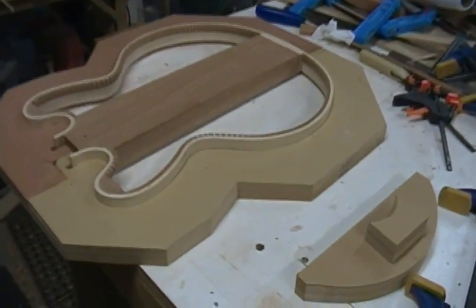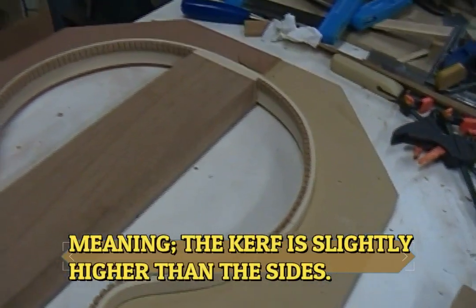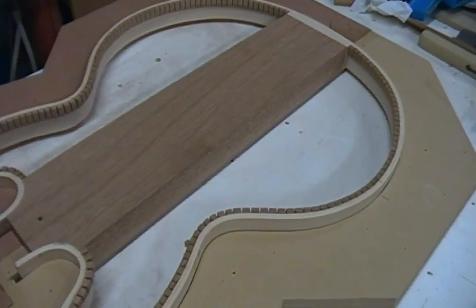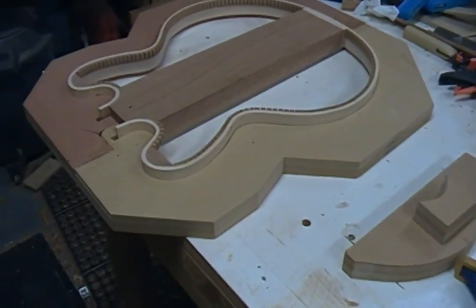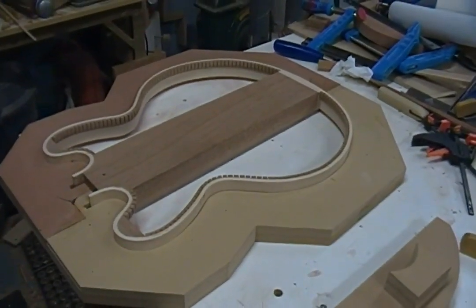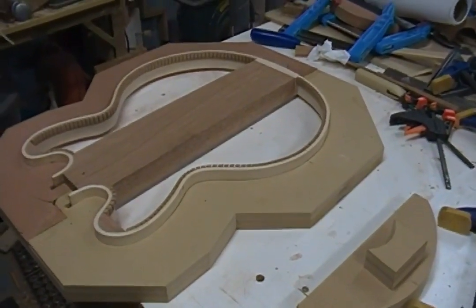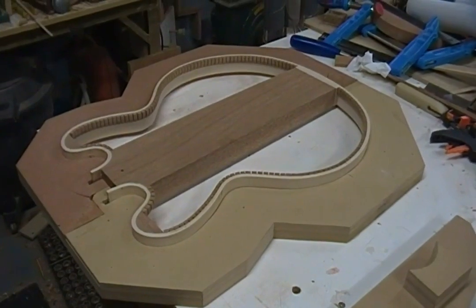I'm going to put it back through the sander — I'm not terribly proud of the rim here, but I'm going to get that flat. This is actually the back. I'm going to get the piece of wood I had prepped for the back, get the pattern traced on it, and start carving that. I'll have to make some router templates. Rather than freehand this carve — if I wasn't trying to match something I would just freehand it — but since I'm trying to build a 335, I'm going to use the plans and the profile lines they put on the plan for the carve. I'm going to router it in, and then I'll hand carve from there.